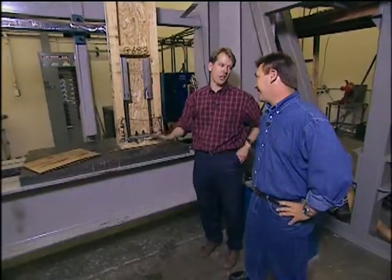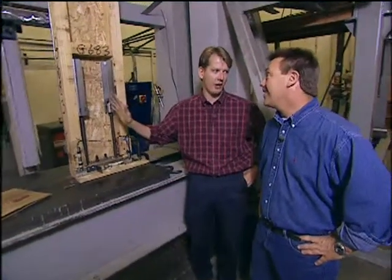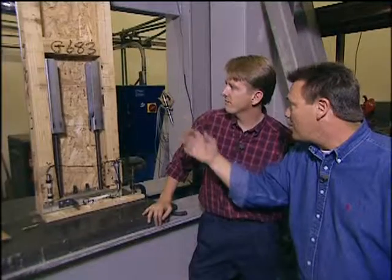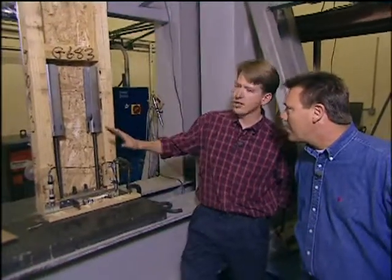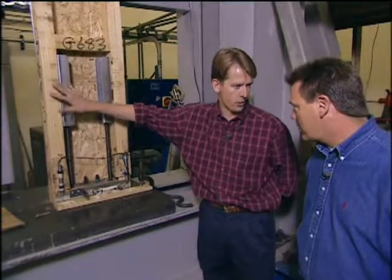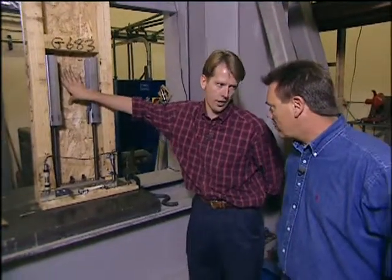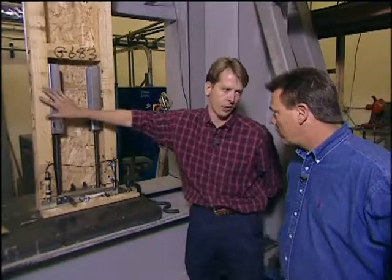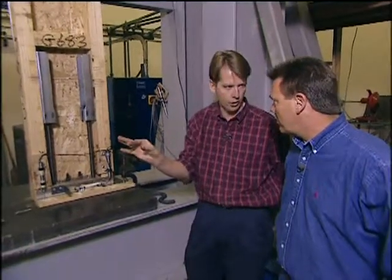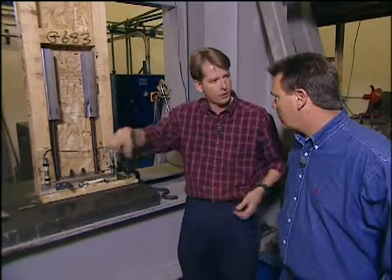These panels aren't designed to deflect more than half an inch on average, so what we're doing here is a destructive test to see exactly how these panels perform. What we've got here is a fine balance between wooden material and mechanical fasteners. We've got the hold-downs attached with the screws we talked about earlier, and this oriented strand board panel, which we call a diaphragm, is attached to the perimeter of this panel with the standard 10-D common nail. It goes through a special U-channel that we developed to get better function out of these nails in shear around the perimeter of the wall.